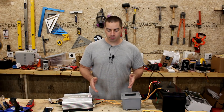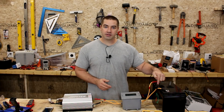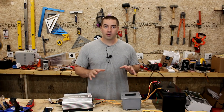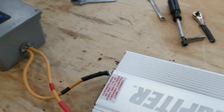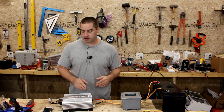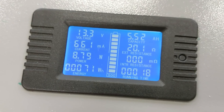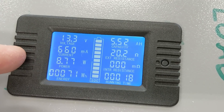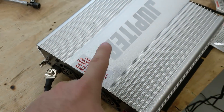If I was to build this again I'd probably offset the box about two-thirds to one-third of the wire length. First thing to do is turn on the circuit breaker — I installed one so I could do all my wiring with no live voltage. Turn that on and immediately the meter lit up. I didn't have to deal with any sparks. The meter is showing 13.3 volts on the battery and in idle mode we're drawing 8.76 watts to power up the inverter.